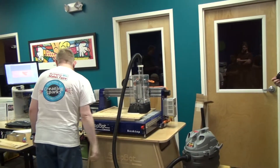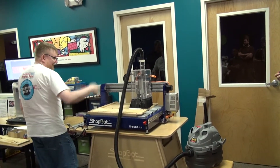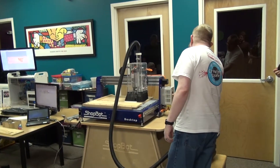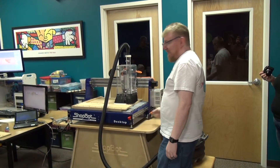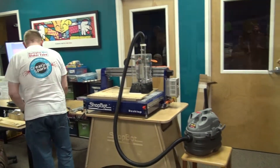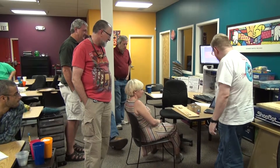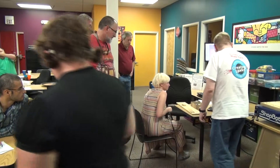I'm just going to power it up. You hear the little fan come on, you hear some things wake up. This is lit up, telling me what I've got it set to. The RPM is not controlled by the software for this model — you manually control it. I'm going to start it off at a low rate and launch the ShopBot control software. On this little screen we've got the console window and a manual control bar. This tells me X, Y, and Z where the machine is.